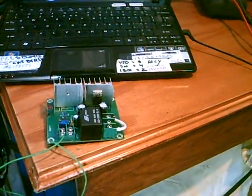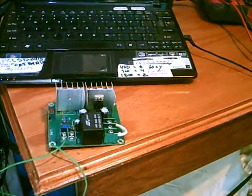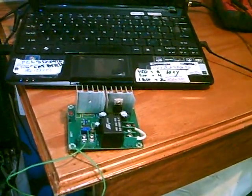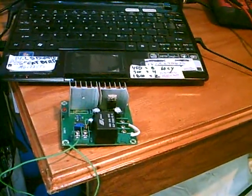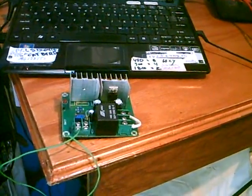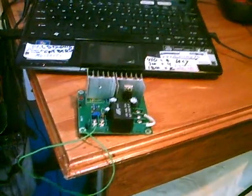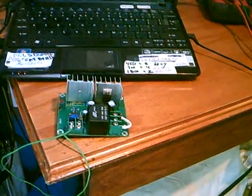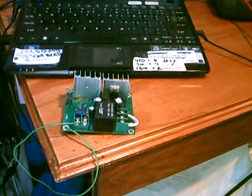The board actually has holes for a TO247 if you want to go that way instead of a TO220. These are 75-volt, 75-amp FETs. You could put in 150-volt FETs that are 110 amps, or go with even higher voltage using the TO247 — so you could run 150 or 200 volts on your water heater element. If you order one of these boards, don't order just one. Get at least three, because if you're not really good at this stuff, you'll blow up at least one board. It's good to have a spare, and you hate stopping a project just when you start getting into it.